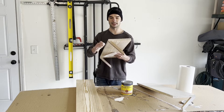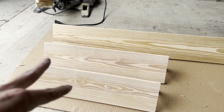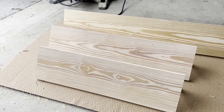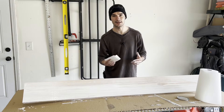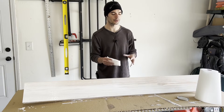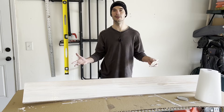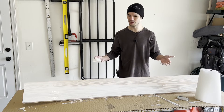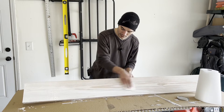I'm probably going to do a second coat in a couple hours once this dries, because I do want it to be whiter than this. Here's a better shot of the three samples — the two in front have been stained white with one coat and the back sample has not been stained at all, so that's your natural yellow pine. You can see a lot more of a difference in the sunlight, which is why I wanted to show you this. I think I know what I did wrong on the first two: I did not mix the stain very well. So a lot of the white stain part instead of the oil was not mixed in well enough — I basically coated the first two with oil or very light white oil. The wood absorbed the oil instead of the white. The third one is hugely better, and I'm happy with putting it up the way it is even after one coat.